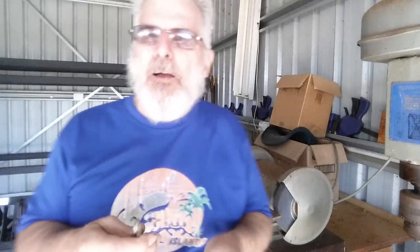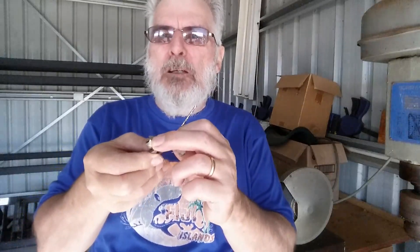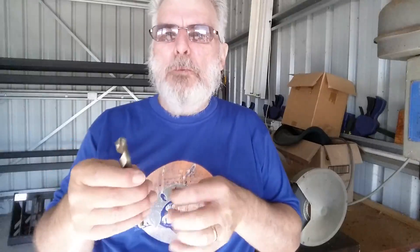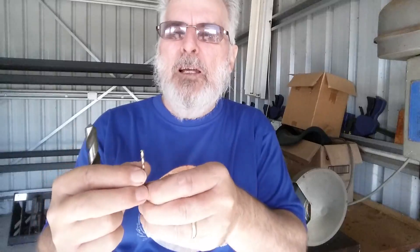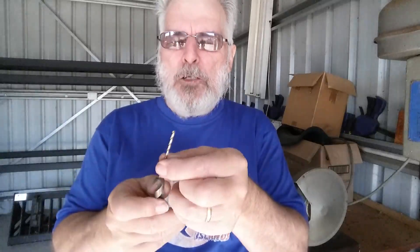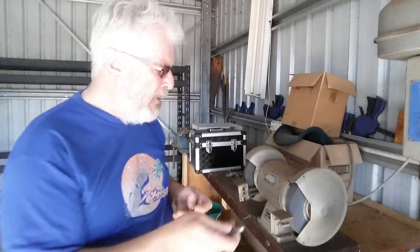On Goldshore Farm I saw Morgan trying to drill into steel in cold weather and having all sorts of trouble, and the reason was this little flat part in the middle of the drill. With a drill press the pressure will force that through, but you must use a pilot hole — because that pilot hole covers that little flat spot so you don't have to worry about pressure on it. The flat spot on a sharpened drill is much smaller, and the steel underneath it just crushes over and goes away with the shavings. Always remember: if you're drilling a large hole, use a pilot, and make sure the pilot is the same size or slightly larger than that flat spot. If you make it too large the drill will wander.